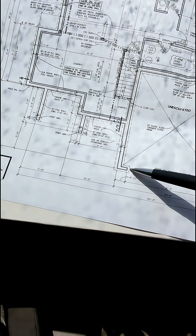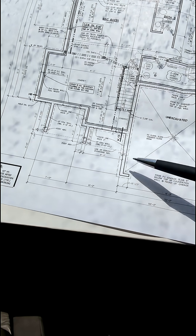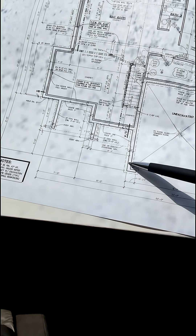See the dashed lines? That represents footings. They use dashed lines because that tells you that's an area behind the area of what you're looking at. This is the foundation, the solid lines. So you can see the footing is wider than the actual foundation.